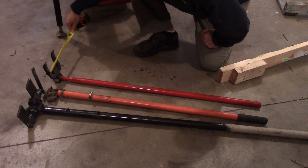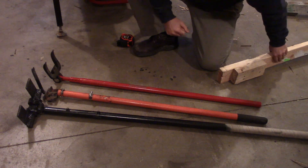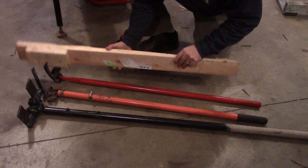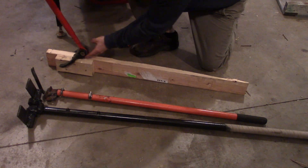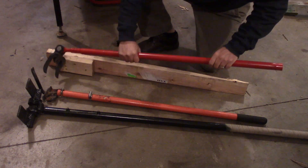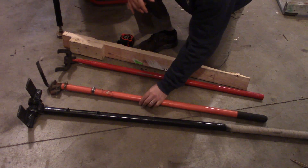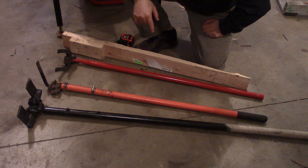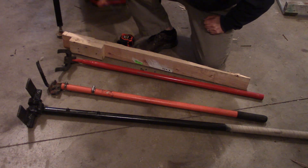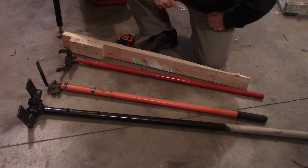The fork on this thing is about five inches wide and the opening looks to be about three and a quarter inches. They designed it so that if you have a double joist on a deck, that fork will fit right on top. It has a cam on the back so when you pry, it rolls back and gives you some extra leverage — and like I said, these tools are all about leverage. If you want to build your own, here are some designs, though I haven't quite perfected mine. If you want to buy one, I'm going to put a link to Amazon where you can get the Crescent DKB44X Bull Bar. It's got the Double Wide Six approval — this thing is a code red demolition tool. Take care.